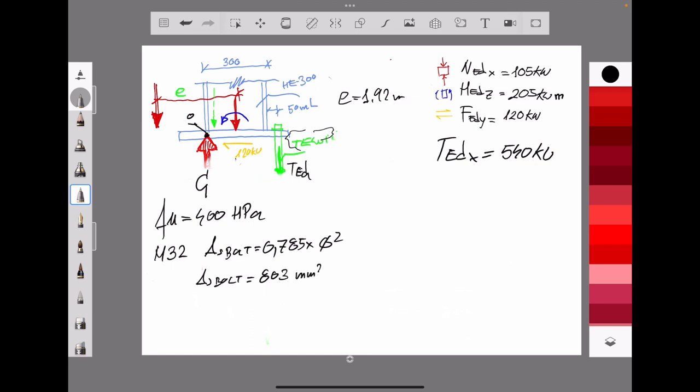So this is more or less 803 square millimeters. In accordance with the Eurocode, when we design the strength capacity of the anchor bolt subjected to tension, we have to follow the following equation. It is 0.9 times the ultimate tension capacity divided by a safety factor gamma M2, and multiplied directly by the section of the anchor bolt. So if we proceed to develop these equations,